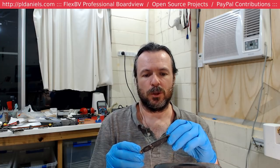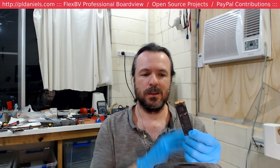Greg, you're right. Samsung on the PC, SSDs, things like that, is very highly regarded. In fact, I use them all the time. But the problem is with this particular SSD controller that they use for the higher performance drives on these 1502, 1466, 1398 type drives, the 12 plus 16 SSD, is that they're all just starting to drop dead now. I think in the last week I've had three or four of them dropping dead. So I don't know what the deal is, but it's kind of like the Apple NVIDIA graphics card, ATI, AMD graphics card failures. So seems like now Samsung's having its time with these drives. You can at least buy drop-in replacement drives for these Macs. They still cost quite a bit, but at least they are available. Transcend makes them now.